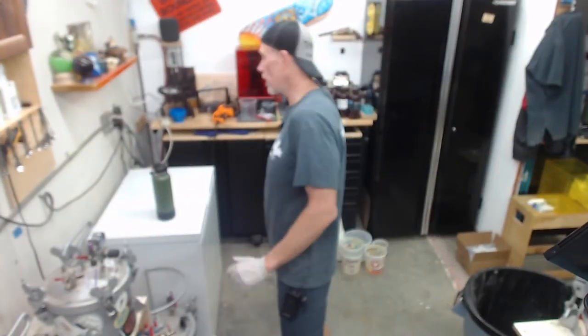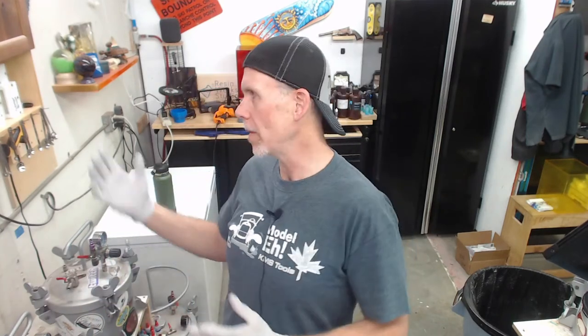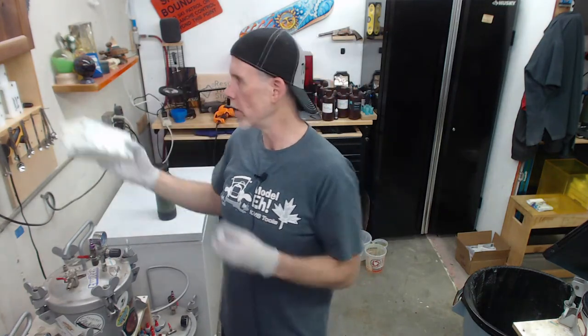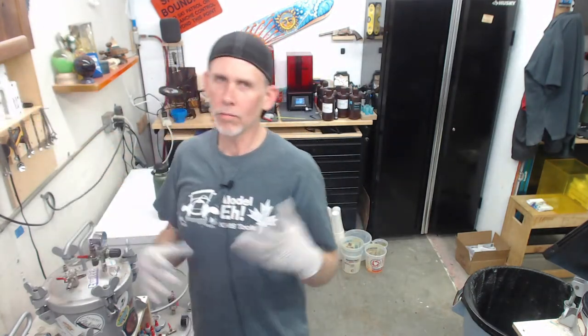So, yeah, same thing with ACC Plus. Most of your epoxies are going to fall into this category where maybe 2 inches by 5 or 6 is kind of the upper limit, like this kind of handle size square block, or a 2-inch PVC pipe. You may be able to get away with maybe a 3-inch PVC pipe by 5 inches tall, but you're starting to push the limits a little bit with most of those epoxies.